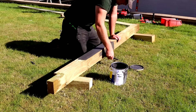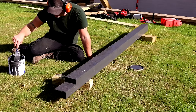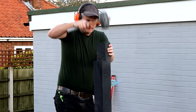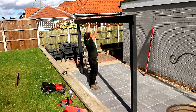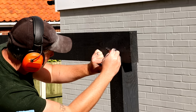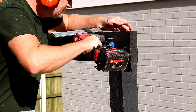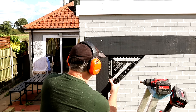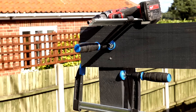I'm not a big fan of how pressure treated wood looks so paint will help make the pergola look a bit more modern. I can then get the posts installed again for the final time. I can get the beam on top and check it's sitting level — it looked perfect. So I can now decide where I want my fixings, drill pilot holes, and then fix it in place with some coach screws. These screws are 6mm thick and 90mm long. The other end wasn't quite sitting square so I used some F clamps to pull it into square and then fixed that in place too.